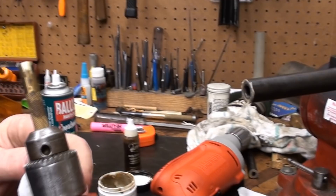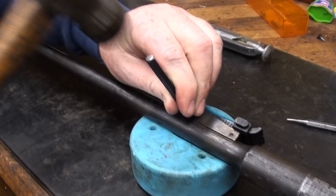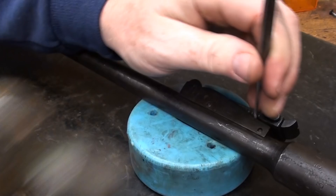It should be nice and polished — it doesn't take a lot. Get these things rolling with a starter punch and find a good one that's real close to the size of the hole, so you don't bend your punch if they're still stiff.